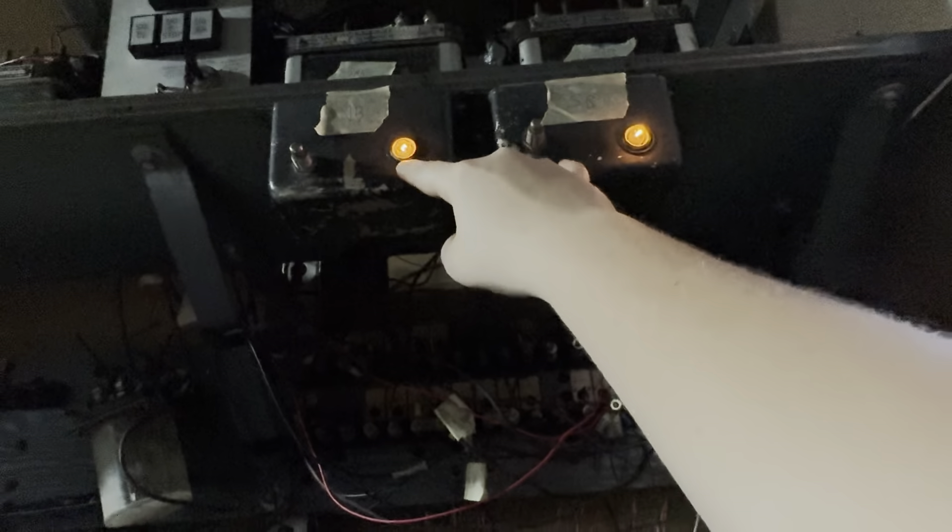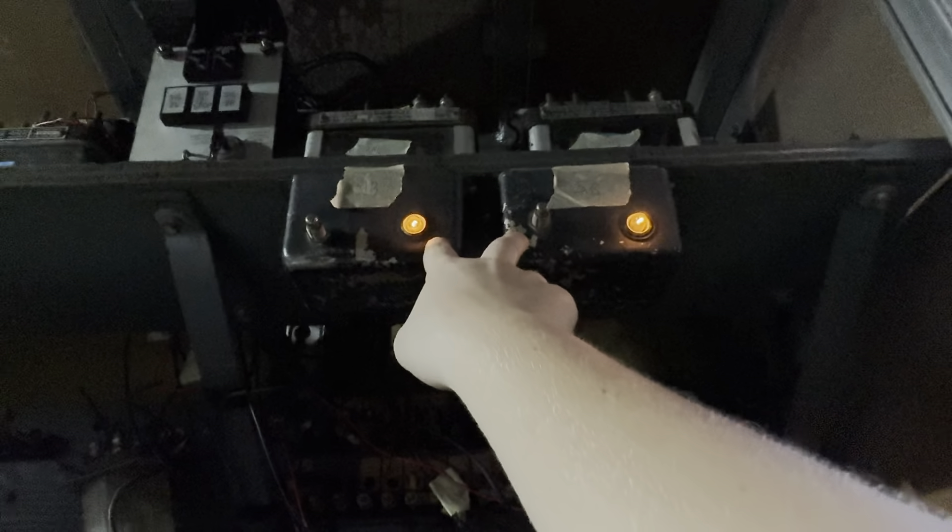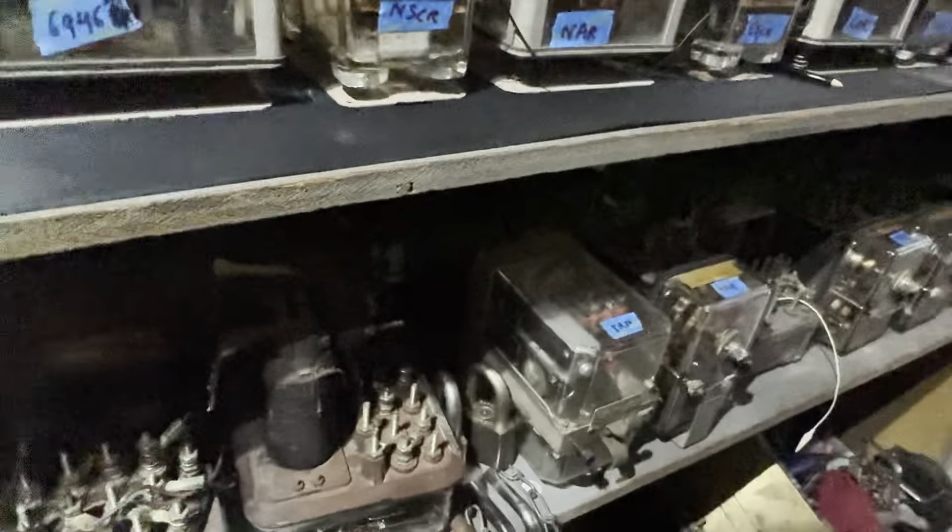I'll line a northbound movement now. These lamps light up whenever the opposing track's signals are set to stop — so if there's a northbound or southbound signal set to clear, these will be lit; but if this is an eastbound signal that's cleared, these will show stop. They only light up when there is a confirmed red signal on all opposing tracks. Here's the northbound time relay — it's a unique one that uses a pendulum and ratcheting mechanism; it's a plug-board style relay.